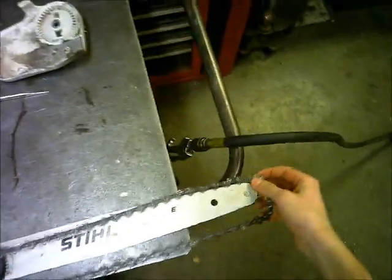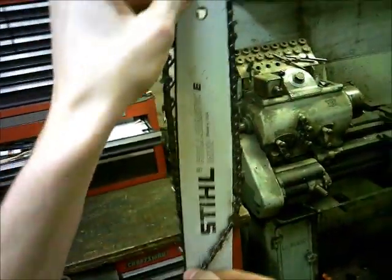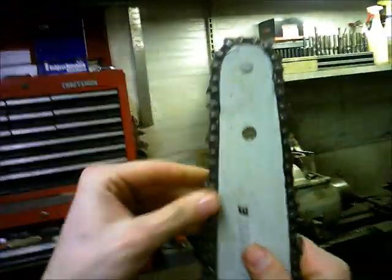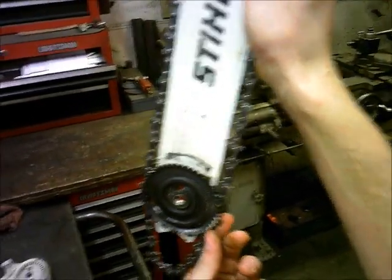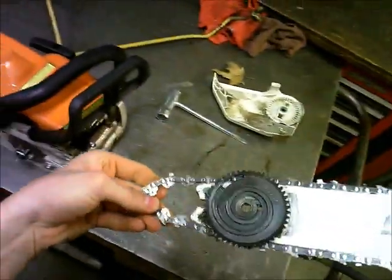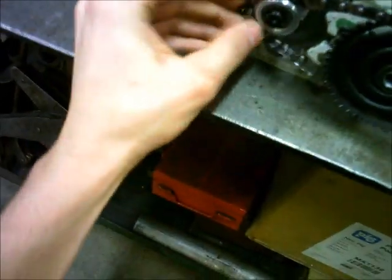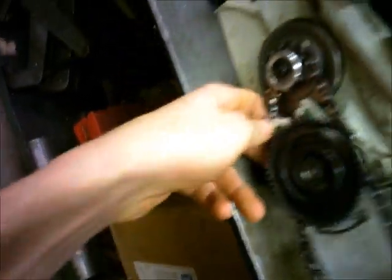Like I say, if all I was doing was cutting firewood where a chain would run most of the day and stay good and sharp, I'd love to learn to hand file a chain real good, but when you burn through a chain in 3.5-4 hours and you're sharpening them sometimes twice a day, that electric sharpener is just so much better.